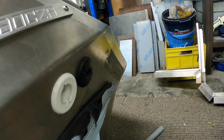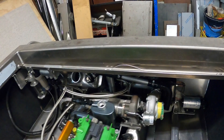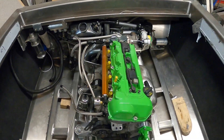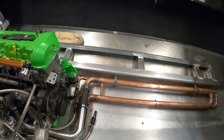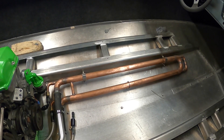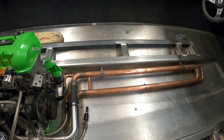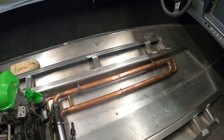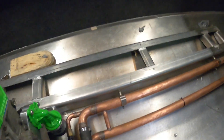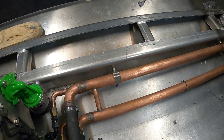Then it comes out the side of the boat as a telltale — if that stops, you want to stop your boat as soon as you can because it will overheat. It's pretty simple and really easy to make if you're good with a bit of easy-flow soldering on copper. It's relatively cheap — DIY, do it yourself, don't pay someone, give it a go.